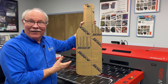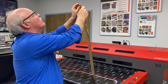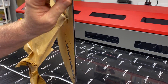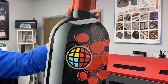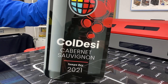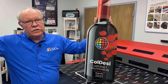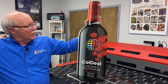Beautiful! What do you think of our wine bottle? Now let's go ahead and peel this off so we can see it. There we go! This is about an eighth-inch acrylic — it appears to have been cut with a rotary type of engraver. You could also have laser cut this out. And then what we did is back-printed it — what's called second surface printing — and then backed that up with white so that the colors show and pop pretty well.